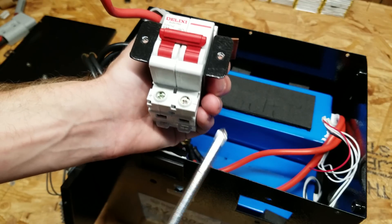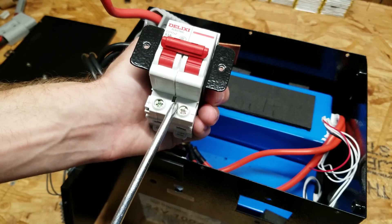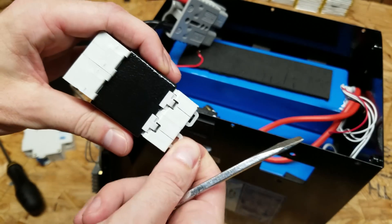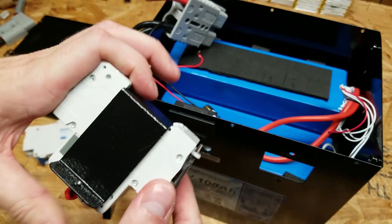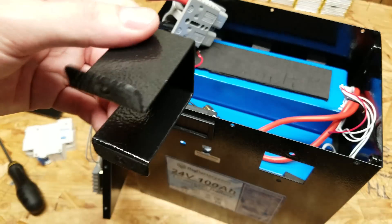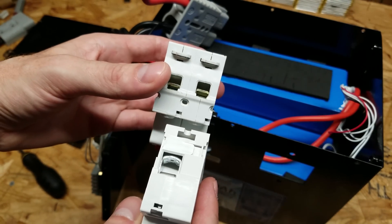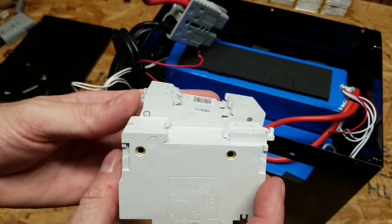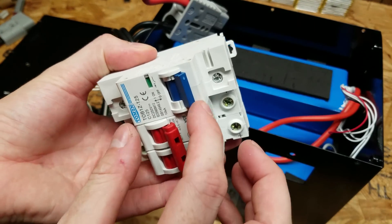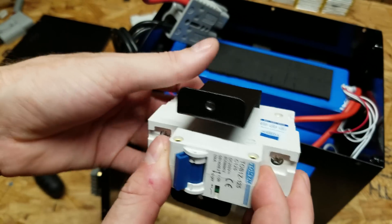We're going to put the new breaker in anyway and retest this enclosure, and then I'm also going to take the lid off the second battery and test that one as well. To get this little strap off, you've got to pull up on both tabs to release it. We can see the thickness of the new one is slightly smaller since it's only a single pole, but the profile from the side — the DIN rail is exactly the same and it's exactly the same height. These are standard measurements. We'll just clip this new breaker onto the same holder.